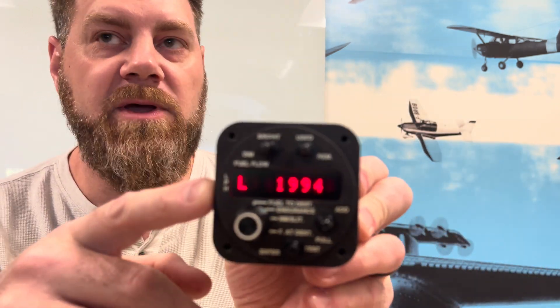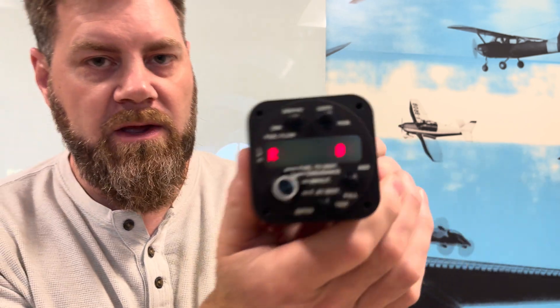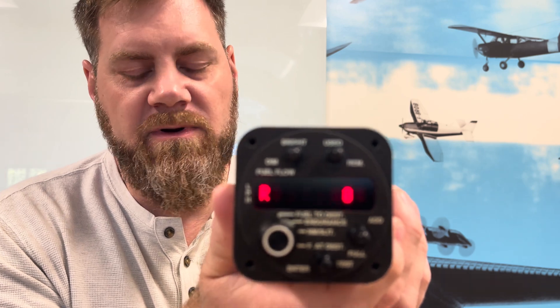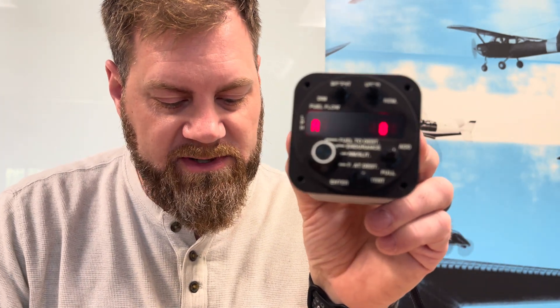This is a single engine unit because it's a 912-04-7T-38-D — a single engine liters indication. You can see 'LPH' (liters per hour) on the faceplate; gallons per hour would say 'GPH' and would be a 912-041T-38-D. Using the Use Remaining switch cycles through the menus. The first one shows the left engine K-factor — L 19.94. Cycling up we see the right engine, which for a single engine indicator is programmed to zero since there's no K-factor for the right engine.